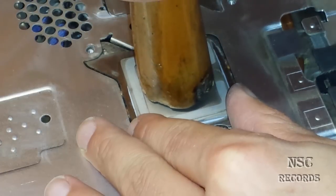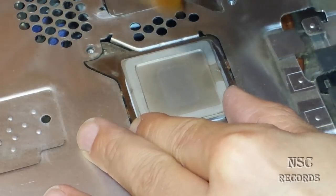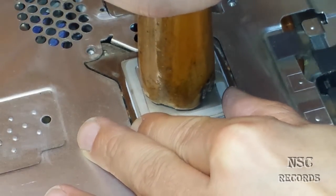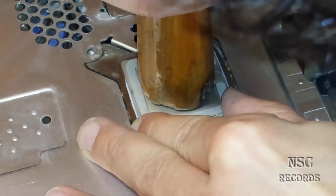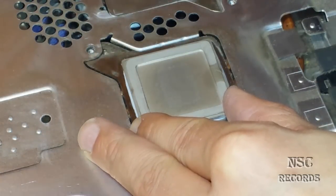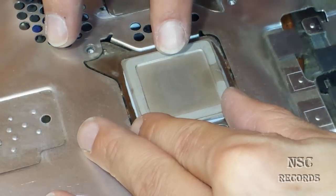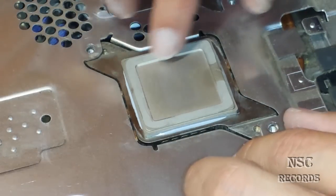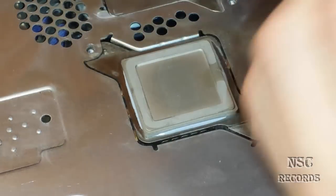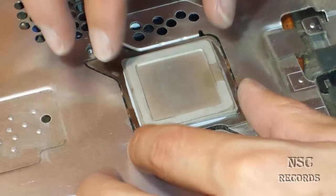I will press a bit more down. While you are pressing down, you can try to move the heat spreader to the right position. This looks good. It's still on the position — and now it's harder to move. You can feel it — it's not swimming anymore because it has a lot of pressure, and that's a good sign. If you can't move it anymore, just leave it like this, because the rest — these screws here — will do the rest. The CPU and GPU holder will now do the rest.